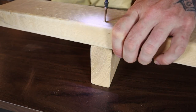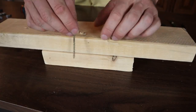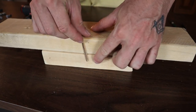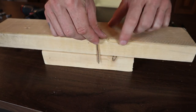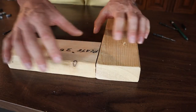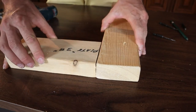Line up your screw right centered in the middle so when you screw it in it doesn't split either way. If you put a screw in and it tightens up and then gets loose, that means it's stripped in the bottom piece — remove it and move your screw over for a fresh bite. For a really tight, permanent connection, definitely think about gluing and screwing together — that's going to be the ultimate joint.